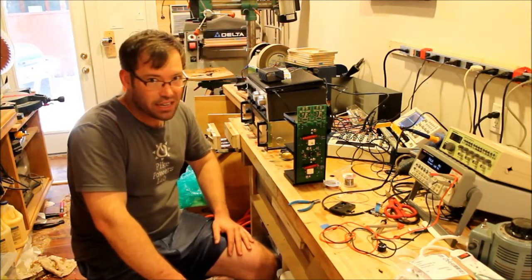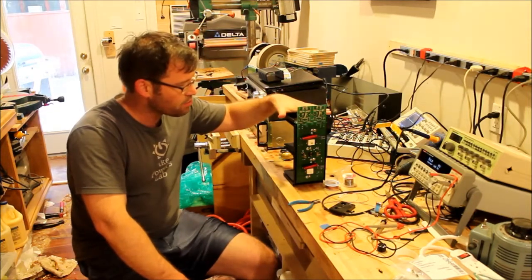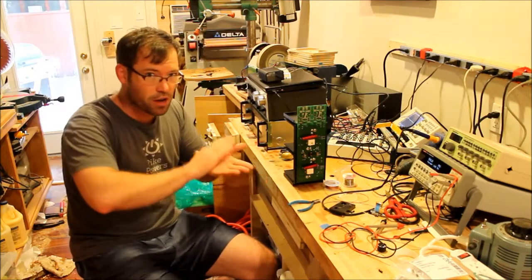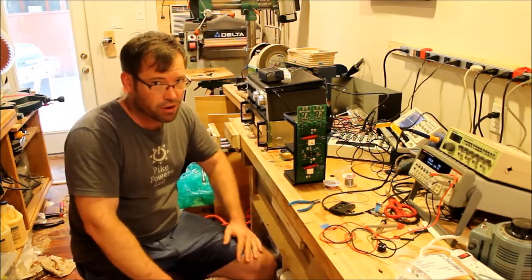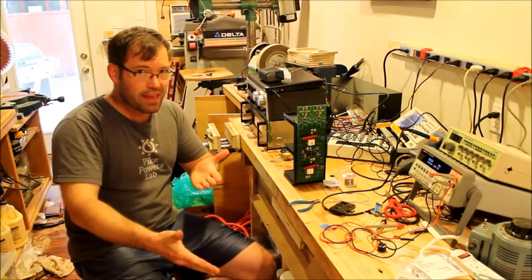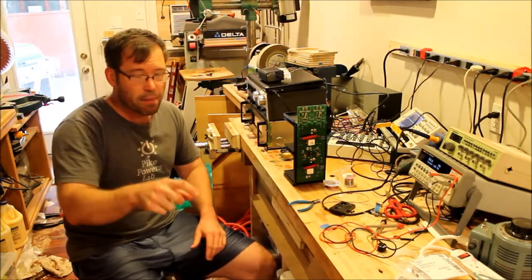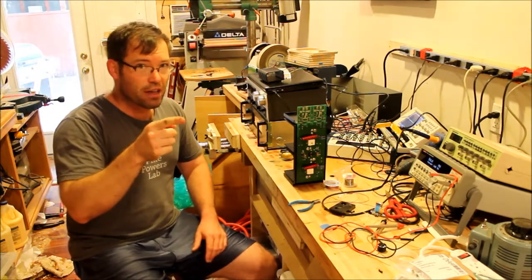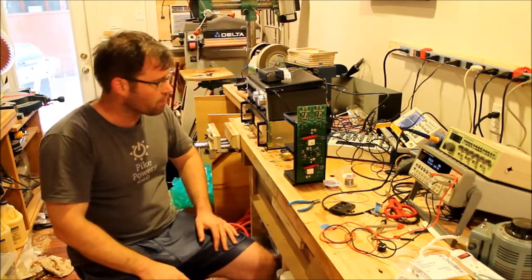They're fine for ICs, but typically the way these boards were made, these components had really long leads. They would put the components through the board, bend the lead over, trim them off, and then run them through some kind of reflow or mass soldering step, okay? And once you bend that lead over, the solder sucker is not going to be as effective. It works great for op amps and things like that, ICs, where the pin goes straight through the hole in the printed circuit board, but it doesn't work so good for these.